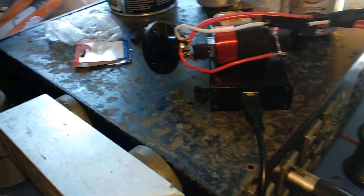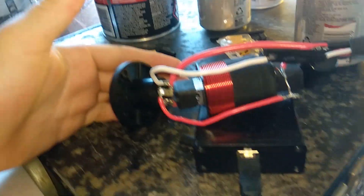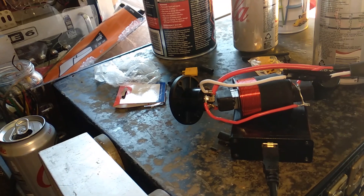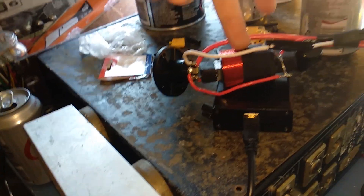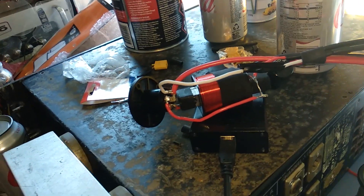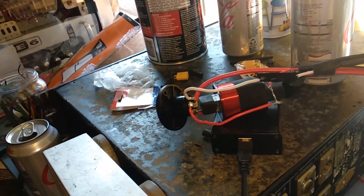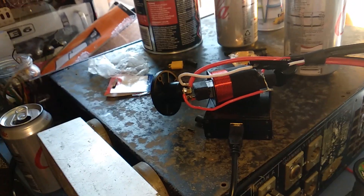Something else I've been working on — I may as well just show this right here. This is a crossover. A basic crossover is a capacitor or an inductor, and a more complex one uses both. So this one has an inductor and a capacitor. The input is a Speakon connector and it separates the signal so you can use either 12dB/octave high-pass, 12dB/octave low-pass, or — I did test it — about a 9dB/octave crossover when combined.